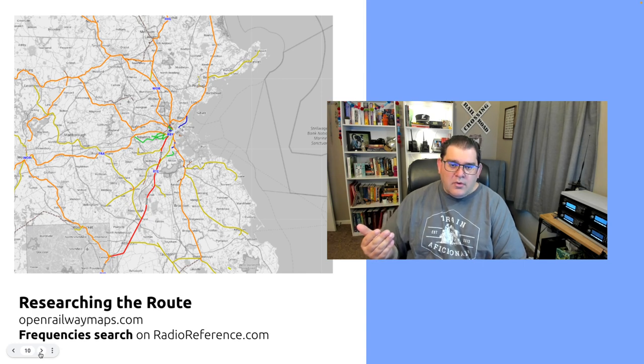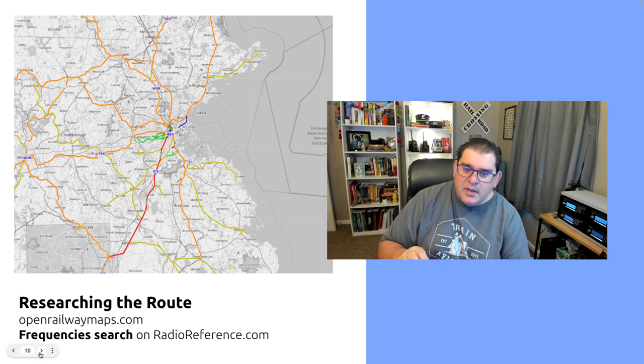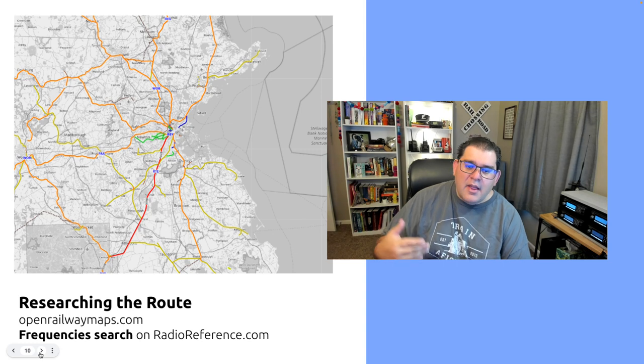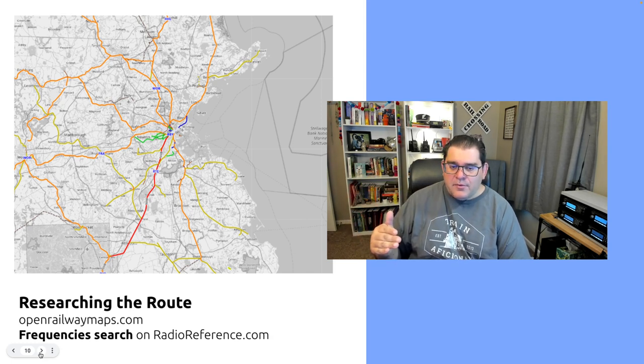So in order to research what frequencies they're going to be on, look up the route on the Open Railway Maps website. If you zoom into the particular line, it's going to show who's on it. Maybe it'll show Norfolk Southern Cincinnati District, or CSX Cincinnati District or Division, or something like that. Once you know the line they operate on, you're going to go to Radio Reference. Radio Reference has a list of railroad frequencies for each state, for each railroad that runs through the state.